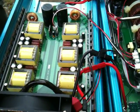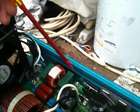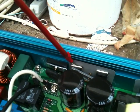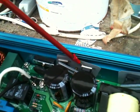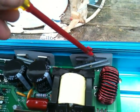I opened it up again and had a closer look, and when you started to look in more detail you realised the shocking quality of the build. These diode bridges here are actually not fixed to the heat sink — the heat sink being the case.